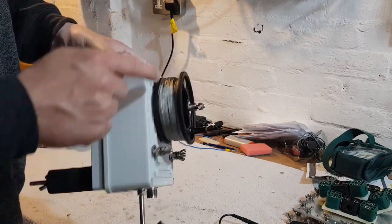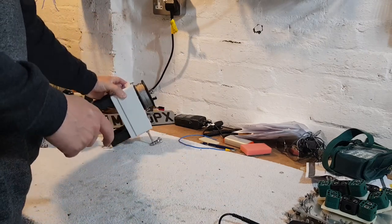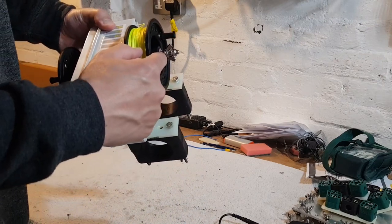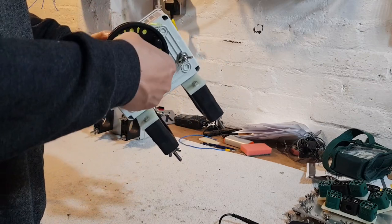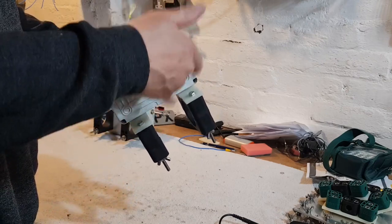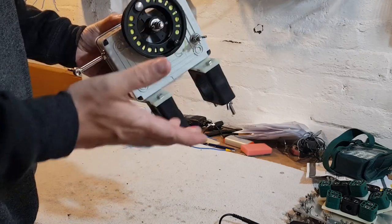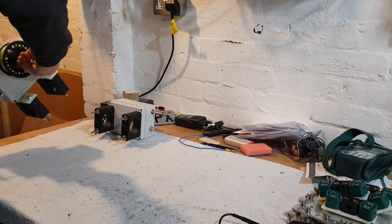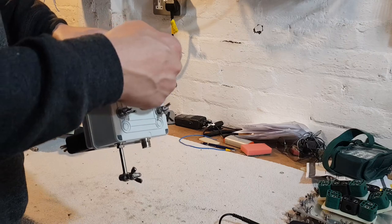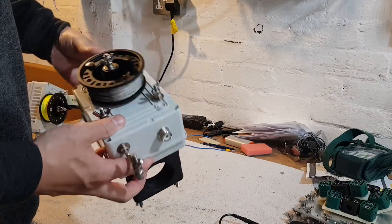Another feature that's going to be on here — one change I need to make is to change this centre spindle bolt. A positive change I've made on the AdjustiWaves going forward is I've actually installed a very basic drag system. So when you've got the wing nut fully backed off, you can see the reel will not overrun. And then once you want to use it, just tighten it up. The Multi will be the same, but due to the configuration of where the bolt is mounted, I just need a 5mm longer bolt — I'll order that and swap it over, which will take me 2 minutes.